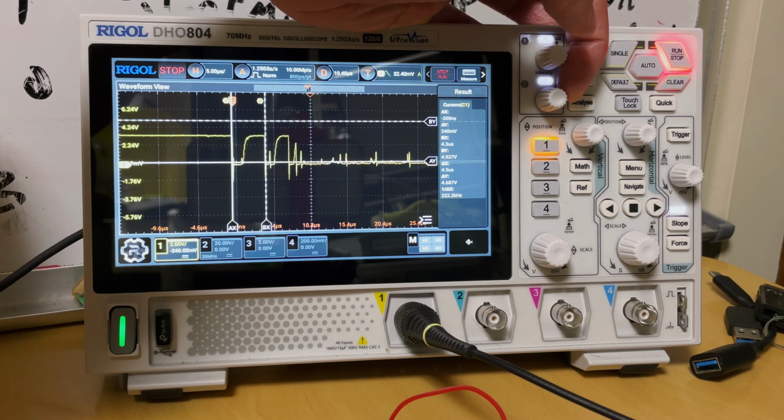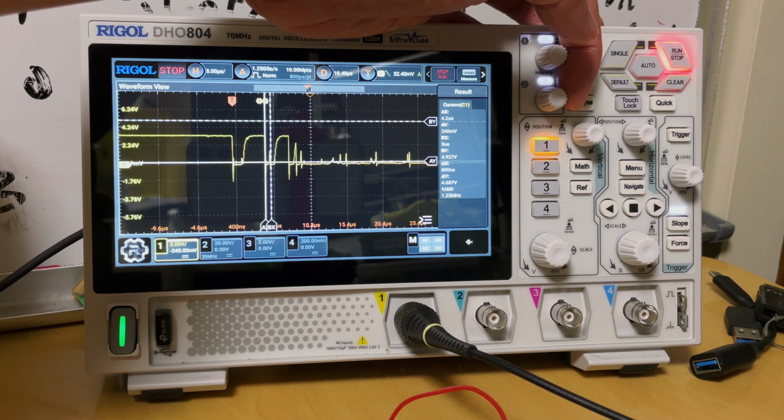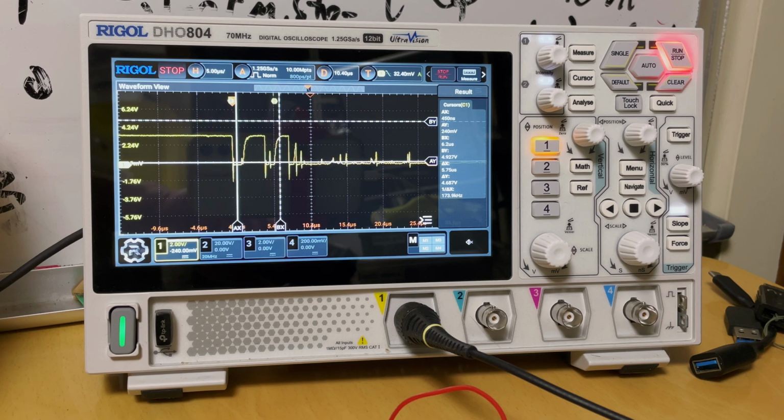And at most, it was like 100 microseconds. And each stutter is like, here, 4.5 microseconds at most, but you can see the usual small ones are like under 1 microsecond. So if we go with the suggested time constant of 100 microseconds, none of these little on-off stutters at 5 microseconds will have enough time to get past that low threshold. Actually, no pulse under 100 microseconds will get through.